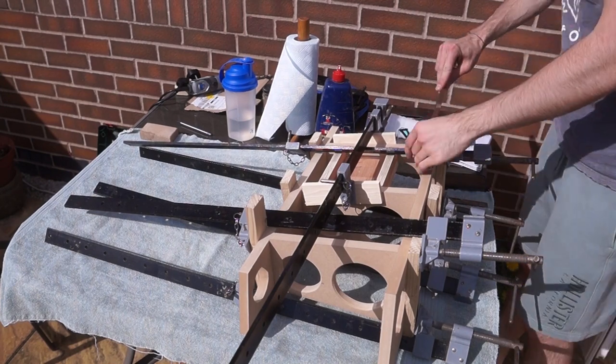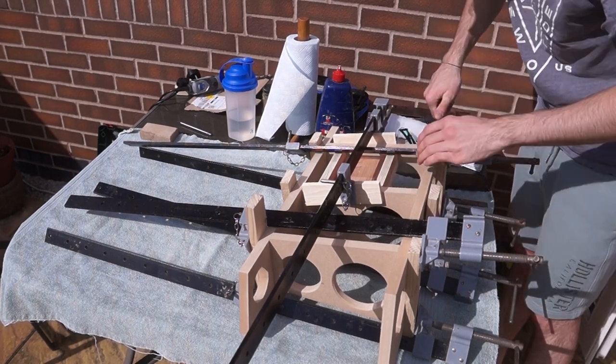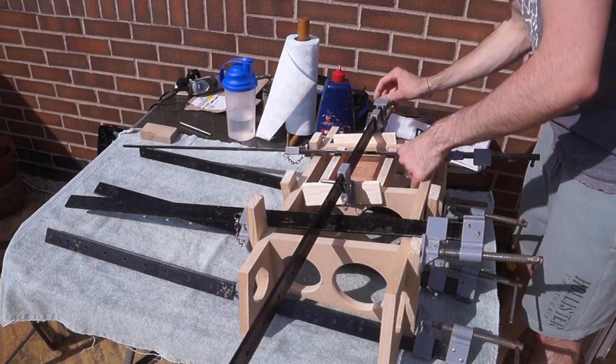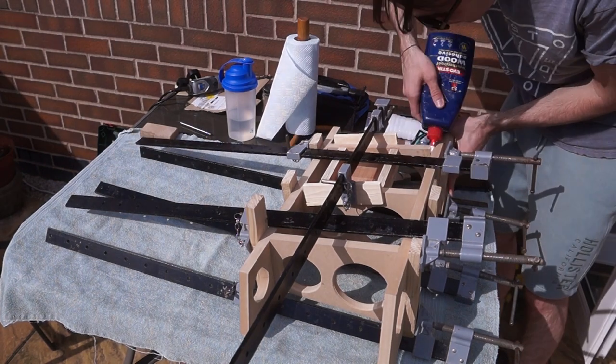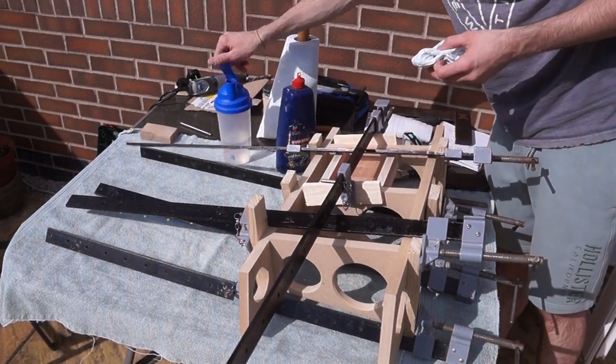The thing did slide around, and I actually came back here with a knife and broke one of the joints here before it had a chance to dry, just so I could pull it slightly more square. Otherwise, I would have had a real planing job on my hands to get it all flush. So, a bit of a mess.